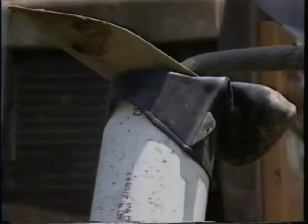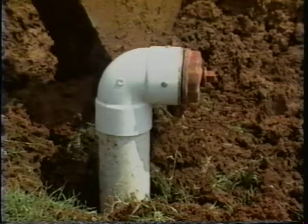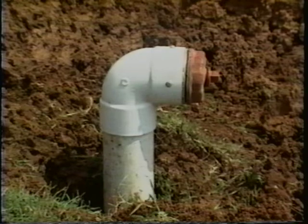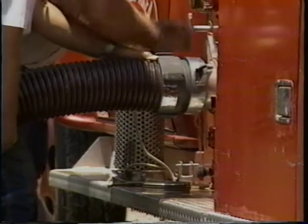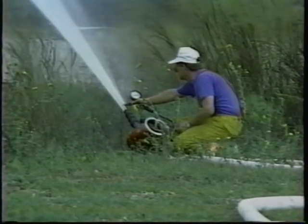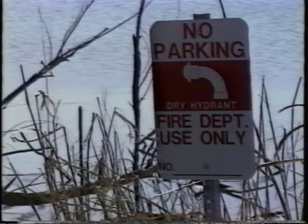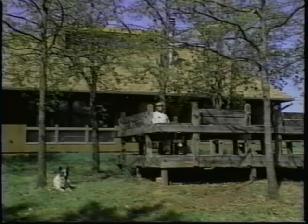If the head assembly has not been placed on the top end of the vertical pipe, the open pipe should be covered. Following backfilling, spread sod mulch or re-sod the area to protect the site from erosion. In a few weeks, the soil around the hydrant will settle and testing can begin. It is very important for the fire department to ensure the unit is drafting water effectively. Add protective barriers and necessary identification signs and paint the exposed pipe to protect it from the sun. The price of the materials used to assemble a dry hydrant will vary between $300 and $500, a small price to pay for the peace of mind and positive insurance rate impact that this kind of fire protection can offer.